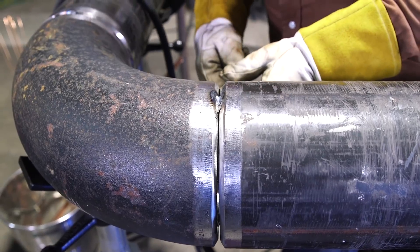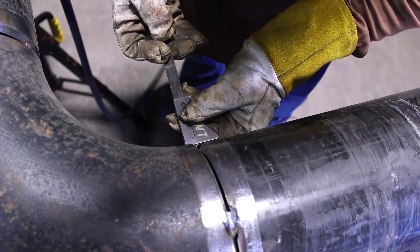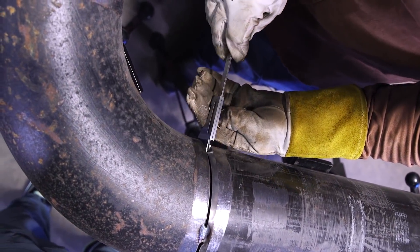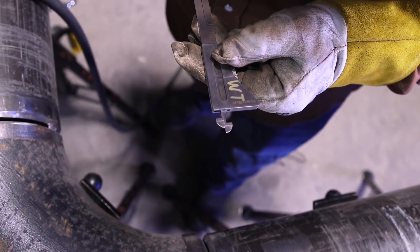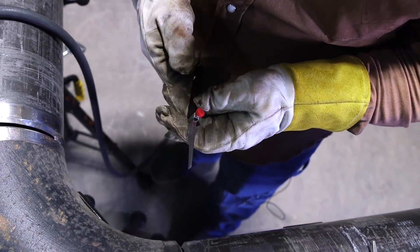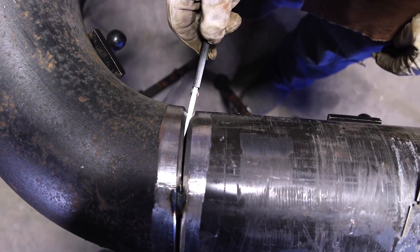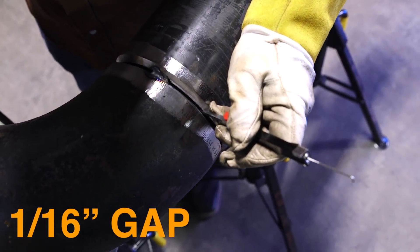As you can see, we're high over here. I'm going to stick this high-low gauge in here — it's so bad I can't even get a reading correctly with this one. I'm going to eyeball it square and tighten up the legs. Those two should be even normally. We've got probably a little bit over an eighth of high-low. This high-low gauge also has a gap indicator with a scale for gap and a taper. It's still loose and maxed out on the scale — over three-sixteenths of a gap on this side, and only about a sixteenth of gap on the other side.